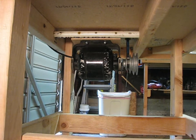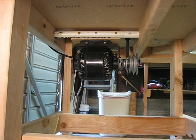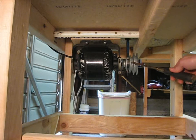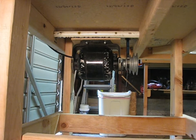The first thing I had to do was build a stand for it. A lot of these old tools don't come with stands because they expected you to make your own, so I made a nice sturdy stand out of 2x4s. The motor pivots on a piece of a bicycle frame, and I left enough space on the sides that I can get it out in less than a minute — important because I only have one motor and I swap it around to different tools. I put a cone pulley on the motor to give me some different speeds, but for the band saw we're only going to use the two smallest cones. The smallest one's for metal, and then the next biggest one is for wood and plastic.